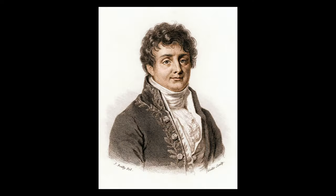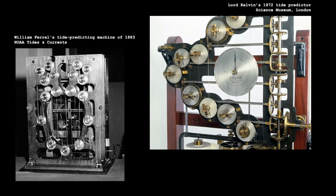I mean, yes, everything can be made out of stacked sine waves if you try hard enough, thank you Fourier, but people were successfully predicting tides using mechanical sine wave stackers back in the 19th century. At their core, they're just a bunch of disks of different diameters, rotating eccentrically at different speeds, with cables running around them to sum up their heights. Sine wave stackers.